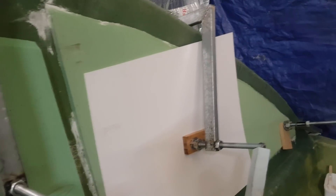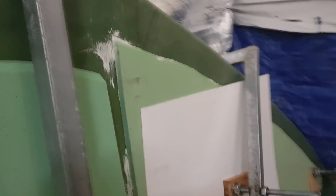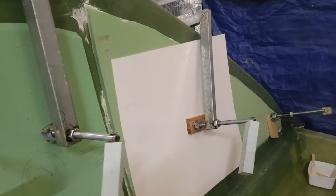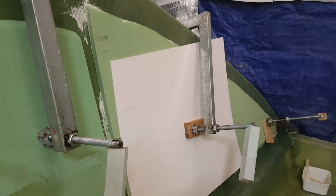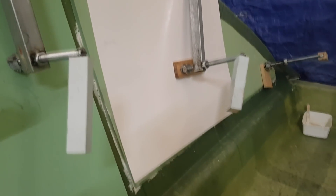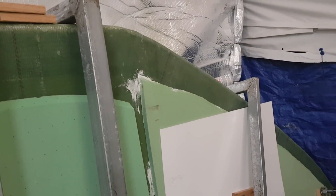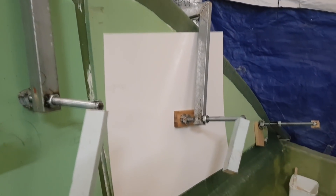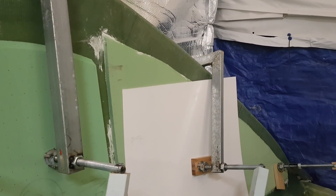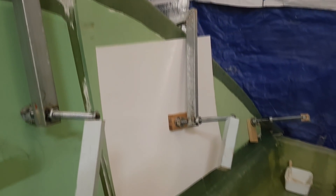I've just put the first 20mm H80 foam on the wall of the caddy and followed the instructions. It's C-Lite, a polyester-based adhesive - a bit like a Q-Cell mix but like ProBond. Catalyzed at around 1.5%, and about four hours later I came back having left a couple of big clamps on it to see if it would bond correctly. It seems to be the business - it's on tight. Over the top of this goes a 300, so I'll just continue putting them on. It's bonded very sufficiently, and with another three or four layers of glass over the top, more than enough without the need to vacuum bag.